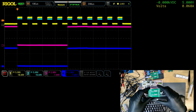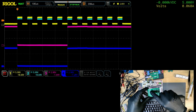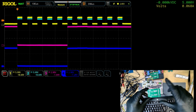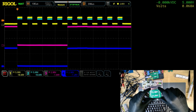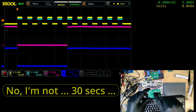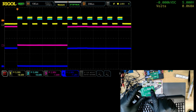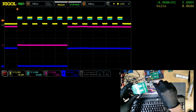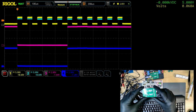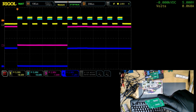Okay, so the plan then will be to redo this. And it does seem that I have wired these outputs up backwards. I was going through the edit history in KiCad, and when I first put them in, I rotated them, which is why they're in the wrong place. Never mind. Okay, so I'm going to change these footprints to the SOP 16s, because I've got loads of these. And then just reroute all the tracks for the LED and for these headers at the end. I might have to move them over a bit, because these footprints are a little bit bigger than these ones. All right, okay, well, when I get them back, it'll be fourth time lucky.